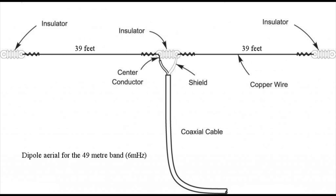The coax — the centre conductor goes to one length of wire. Make a good joint there, wrap it round and solder it, because don't forget this is out in the weather, in the rain. The shield of the coax, the braid, you take to the other piece of wire. You will need to put a bit of varnish or mastic or something on the coax there at the end, otherwise you'll get water going into it. So seal the end with something — a bit of tar-type stuff, bitumen, varnish, whatever.